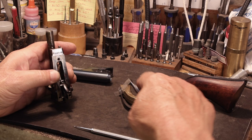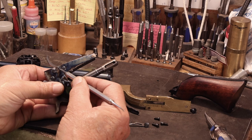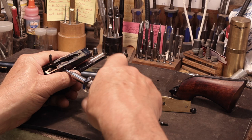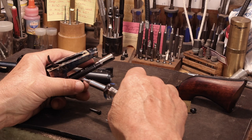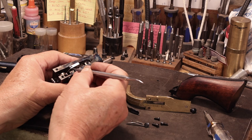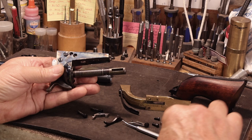Roll her over. On the left side of the pistol you'll see four screws. We'll start with the front one and then take the one behind it out. Pull the trigger out and the bolt. This next screw on the 60 Army — we don't have to worry about that one; that is a stock screw for a shoulder stock. Since we don't have that, we'll be going to the rear one. That's your hammer main pivot screw.